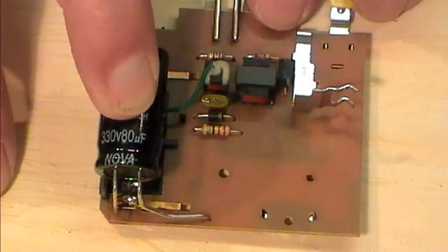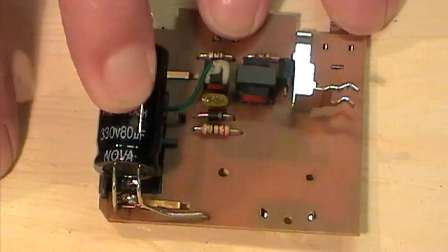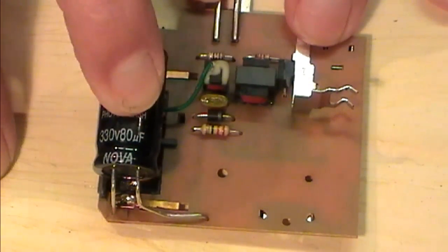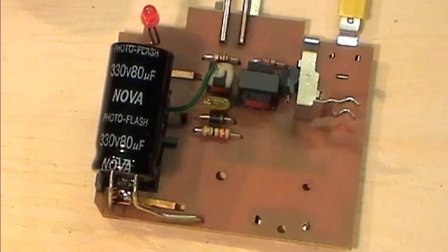Now the UF is, if you like, the microfarad rating of the capacitor. He's saying that 330 volts at about 220 UF is pretty much perfect, though with mixed results. He's saying it's sort of a play thing. You need to monitor your output voltage, and when you hit your charge button, you can watch that go up to sort of 60-70 volts.